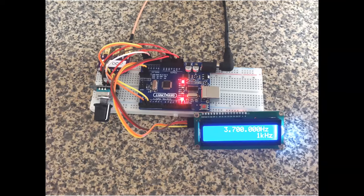Great little software-defined radio. But also there's a guy, I think it's called Steve Andrew, who's an Australian ham, who's written some software that turns it into a spectrum analyzer. I mean, obviously not as good as a Rigol or a Siglent, but it will work. You'll need some kind of signal generator to put a signal in through it if you're testing something, but it works really well and will give you a really good idea about what you're looking at. So that's something to watch out for.